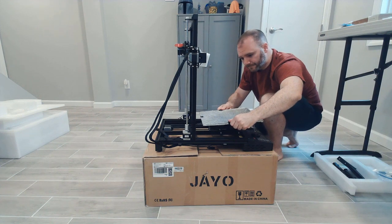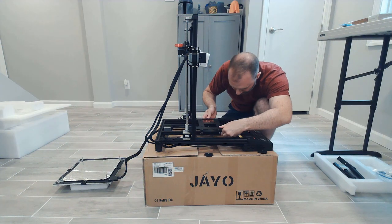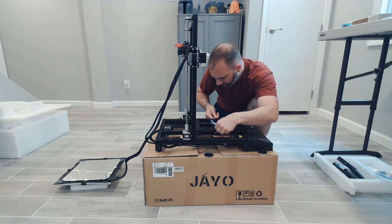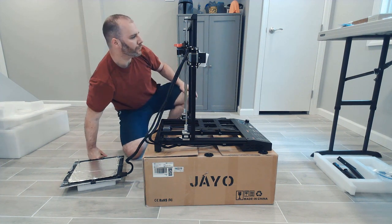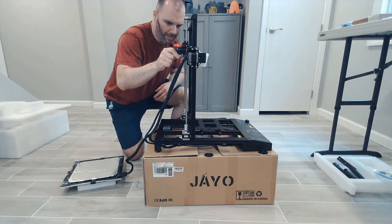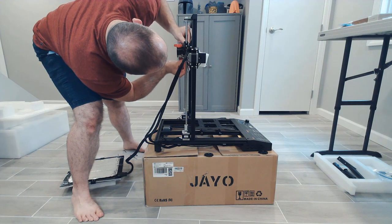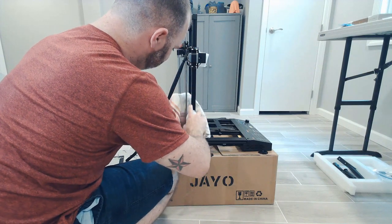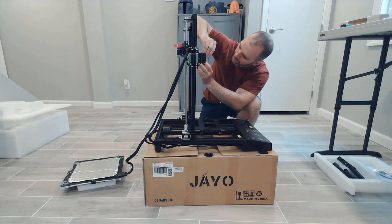After tightening the T-brackets, the assembly is kind of done. Now I go over the printer, check everything, and do my upgrades. The things I upgrade on printers like these are the springs and the Bowden tube. So I take off the glass build plate in preparation for upgrading the springs, check the build plate, check the eccentric nuts for wobble, make sure the belts are all appropriate. I check my motors — Z-axis motor, extruder motor — tighten if loose. I check the Z-rods and actually noticed my extruder motor was loose, so I tightened it up. I also noticed my Z-rods were ungreased, and you want those greased since they're constantly under mechanical tension.